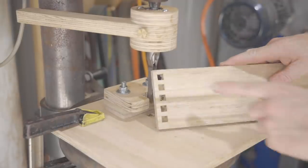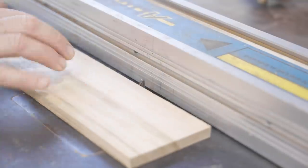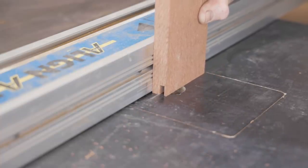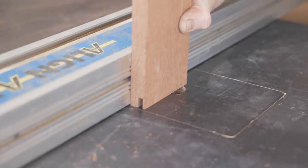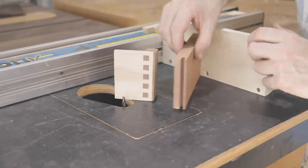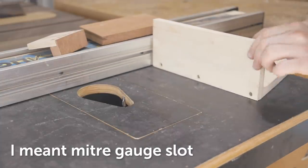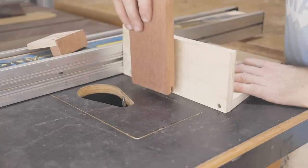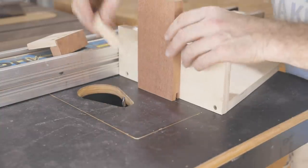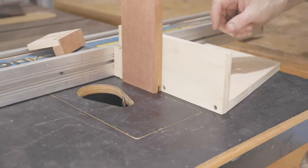That works a treat. Now onto the other side of the joint — the first part is very easy, we just need to make a quarter inch groove along the edge. That needs to be 3/8 of an inch, or the width of the mortising bit, away from the fence. This piece should be at least 3/4 of an inch or 19 millimetres thick — my piece here is a little thinner at 18 millimetres and doesn't leave much material at the shoulder. The last part of the joint is to make cuts through here and leave tenons, like on this test piece. To make that test piece I used a couple of bits of plywood screwed together; I don't have a t-track on my router table but I just ran it along the fence and that worked fine. Then to stop so we don't come through the front I set a stop block, and to make the individual cuts I kept adding plywood spacers and making each cut — but I think I've got a better idea.